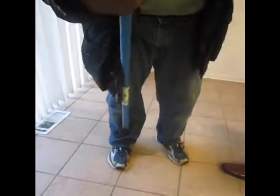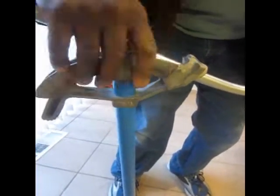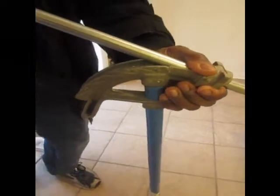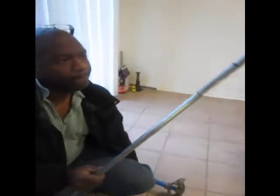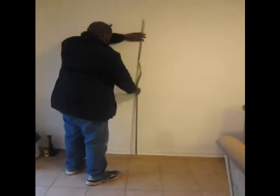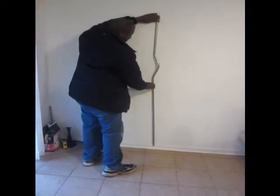Now I am going to flip it and I have got to flip it this way. There it is at the arrow mark — I still got my second one right there at the arrow mark. Come down here, make sure I am still straight, and I am going to make a 22 degree bend. Now the problem comes in if I over bend a little bit — sometimes I do that. Both of my bends have to be exactly right, so give it a little bit. That means one of my bends wasn't exactly 22 degrees — that is what that is — and there is my offset.